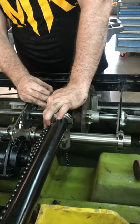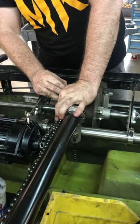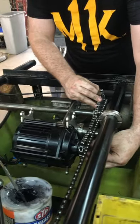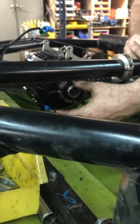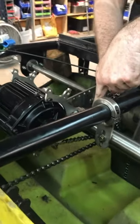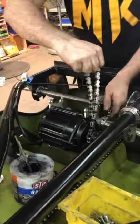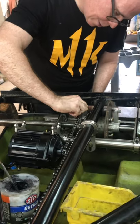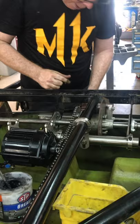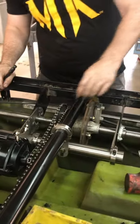What I'm looking for is that when I press down on the chain it's not touching the crossbar, and I can adjust the motor position to give a little more clearance. I'm trying to get the motor nose in the middle of the two pedal chain runs — upper and lower — and we've got plenty of clearance on this side. I've got the half link in, I've got the master link in my hand; I'm going to wrap it around the motor sprocket and engage the axle sprocket.